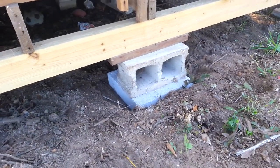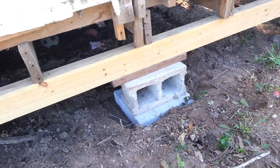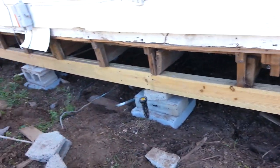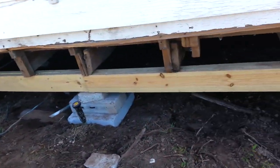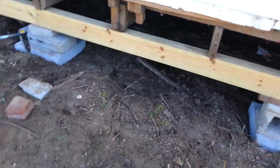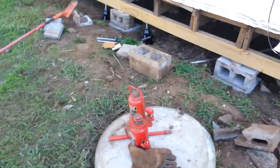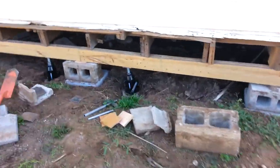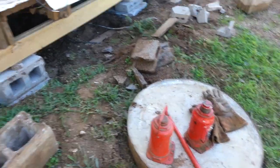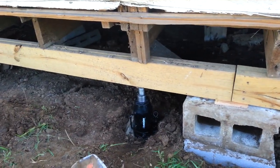It will settle some — there will always have to be leveling done periodically after rains. But if we can keep a skirt on this house and keep the water and moisture out, then it will stay pretty close to its original position. I use 20-ton hydraulic jacks. I don't use 3-ton, 10-ton, 12-ton, or 2-ton. We're lifting a huge house here — this is not a dollhouse, this is serious business, and so we need serious lifting power.